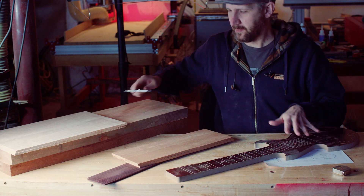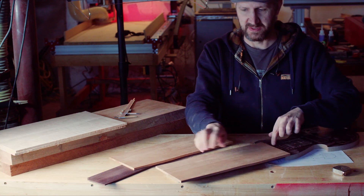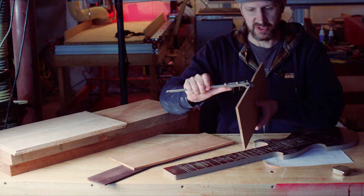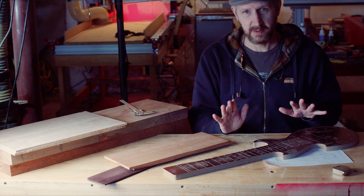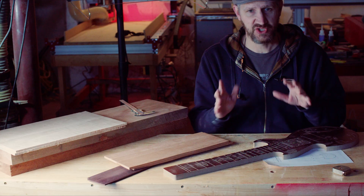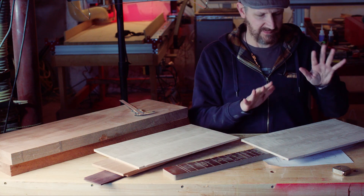Next I have these pieces of mahogany. These pieces basically balance out the veneer — the quarter-inch veneer that I have in the top part. They're placed up in the neck section, glued to the main body blank. They'll be a quarter of an inch, but right now I have them at about three-tenths of an inch — a little bigger than needed. I'm going to mill and thickness sand everything to dimension after the glue-ups.